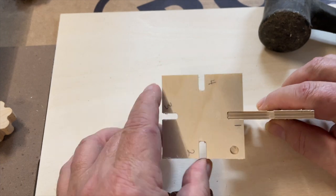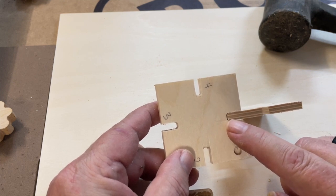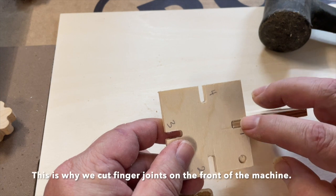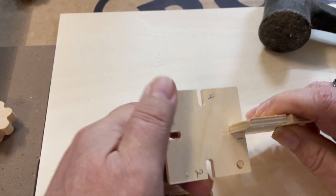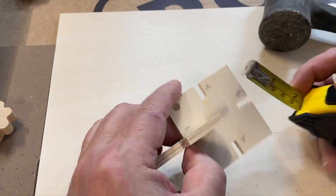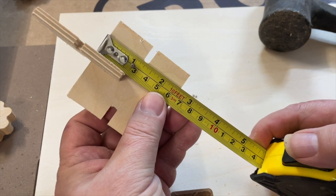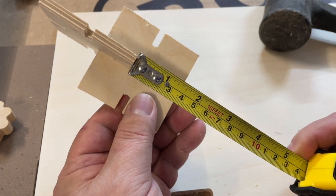A couple of other things to note: when you've got a flat edge piece going into another piece, you'll notice all of these have a slight curve from the bit and you'll get gaps. So it's not really a good joint on its own, but when you put the two together back-to-back you get a much better joint. Also note that all of my notches are about a half inch deep, but because I've got two of them together, you need to allow for a full one inch for all pieces to sit, otherwise the pieces will hit each other.